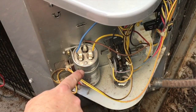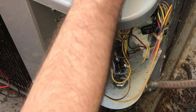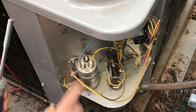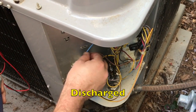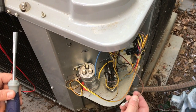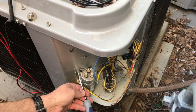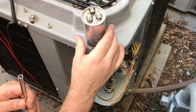Now this right here is the capacitor. Don't touch it. What you want to do is take a screwdriver and run it across the two posts — this way, this way, and this way — to make sure the capacitor is discharged. Then you can pull these wires loose and make sure they're not touching anything. Remember what order they're in: the brown went to the fan, the yellow went to the common, and the blue one went to the Herm — H-E-R-M. You can test this in place if you like; I'm just going to pull it out closer to the camera.